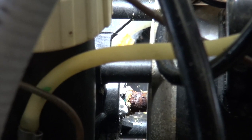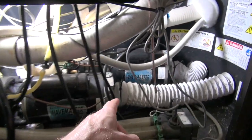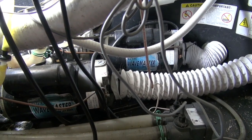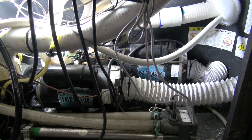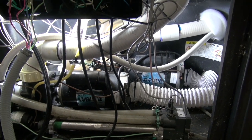I'm going to remove the pump — there's a lot of stuff here in the way. Basically on this it looks like there's two bolts. Somebody's replaced this before and broken that. You've got the pump union right here on the suction side, and this one on the pressure side. Then you've got to deal with this little crazy doolally that they have in the back trying to pull heat off into the cabinet. Both of these pumps have the same build up, so I'm going to go ahead and replace the seals in them.